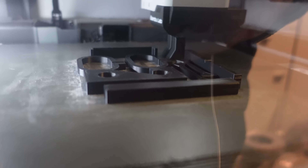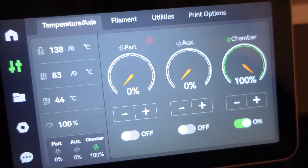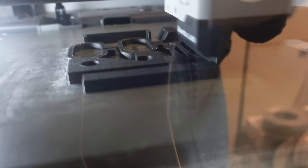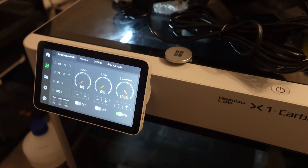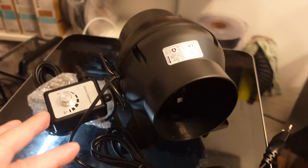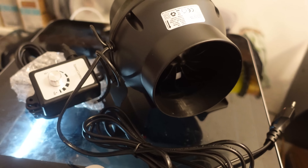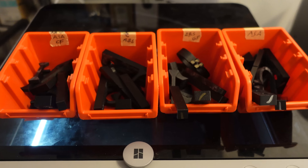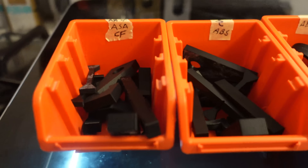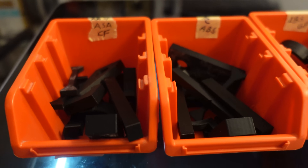ASA printing finished without problems, but the smell was much worse compared to ABS — I had to enable the exhaust fan before opening the door. Glass fiber ABS and carbon fiber ASA also printed fine. The ASA-CF has a very bad smell, and after printing I enabled the exhaust fan but it's not strong enough to push air through the pipe, so I'll soon install an inline fan. To avoid mixing up the parts, I marked two of them with silver and gold marker lines, and I can recognize the others because ABS has a shiny surface and ASA-CF has a matte surface.